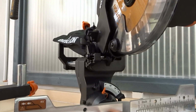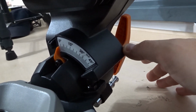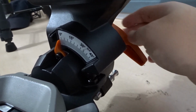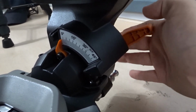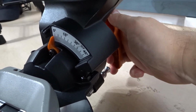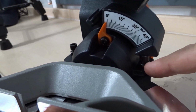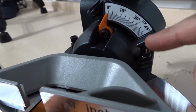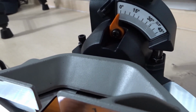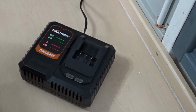with this saw. So as I was saying, to get the blade square with the table, fence nice and square and adjusted, you've got this bevel knob here. I'm actually going to tighten that up now because that's set where I want it. And you've got these nuts here that you can undo, and then you can adjust these Allen keys which adjust this. So this is now set on my machine perfectly square to 0 degrees.